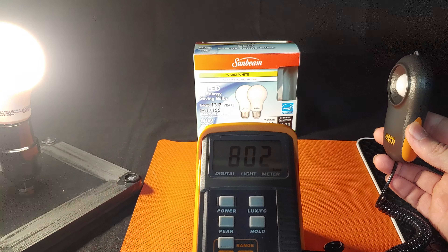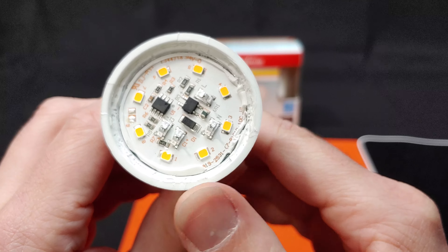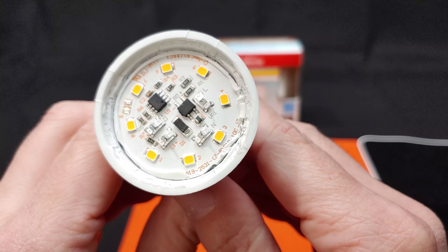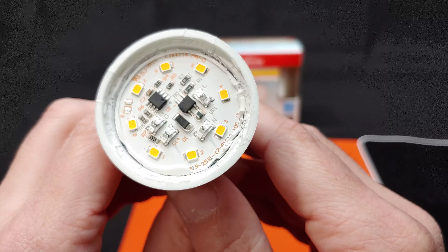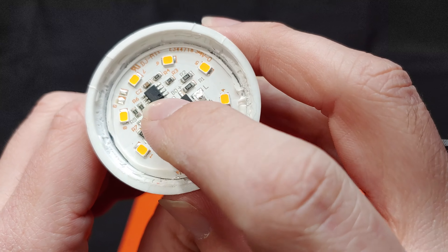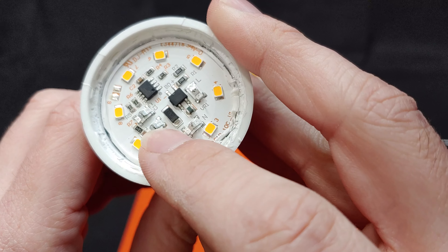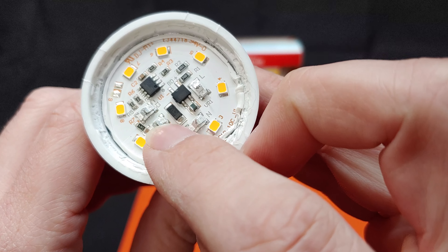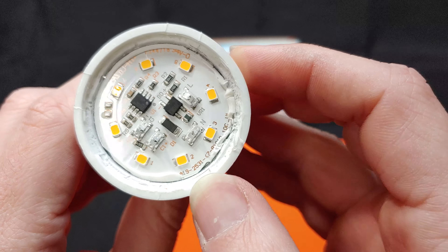Let's rip off this diffuser and see what we've got. Having ripped off the diffuser, we can see inside the bulb we have 8 LED chips this time, rather than the 11 of the previous bulb. I'll put a link to that review in the description below. If you guys are liking these videos or enjoy the content, give me that thumbs up and subscribe to my channel if you haven't done so already. Looking inside, we have a small microcontroller, a number of resistors, and looks like we've got our power inputs for live and neutral. Looks like there's likely a capacitor on the back end of this. I tried to tear out the elastic holding it in place, but I couldn't get the board free without damaging it.